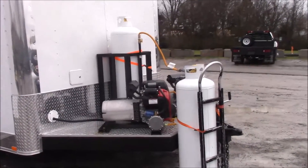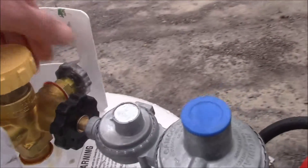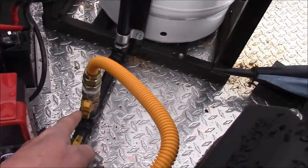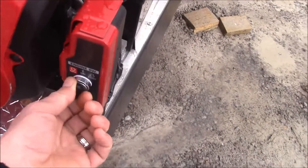I'm going to show you how to start up your generator or generators. First, you've got it plugged in. I'm going to have this switch off, and this switch off. I'm going to have the gas on — I've got it hooked up to a live propane tank. You want to make sure this gas valve is open and everything has a good, secure connection. Then we'll have this gas valve on, running in line, meaning it's on. Same thing here. With that being done, simply start.